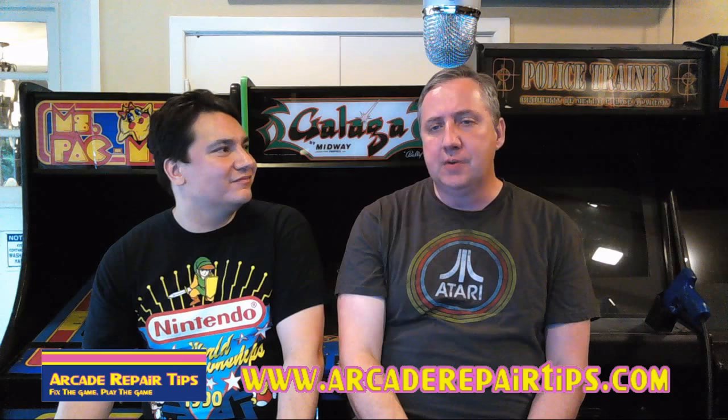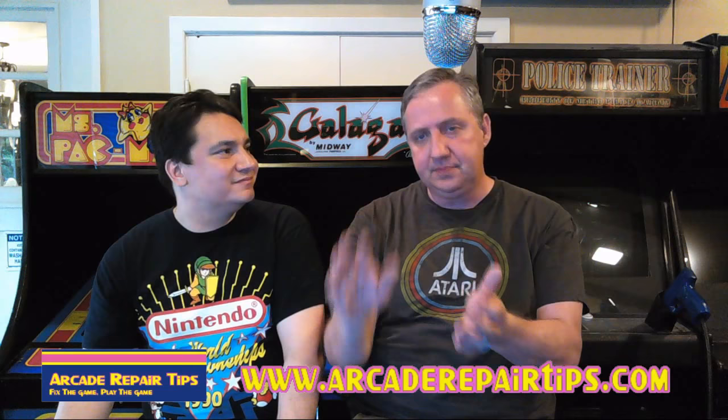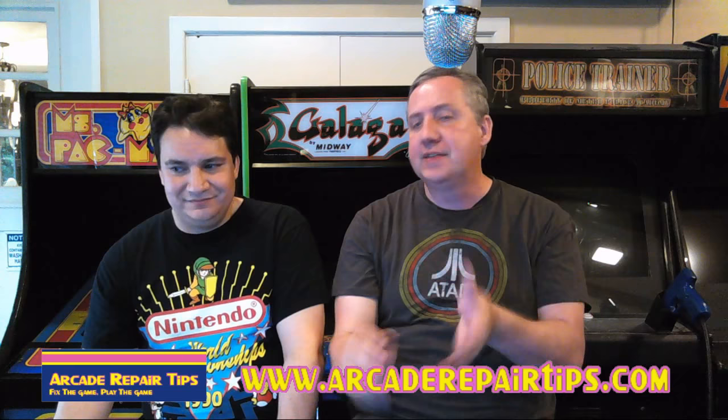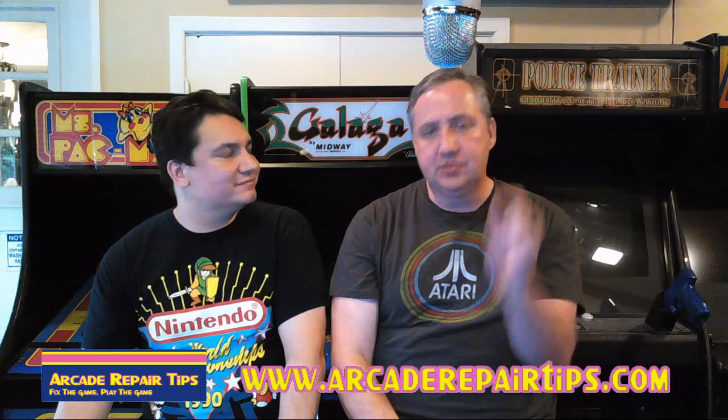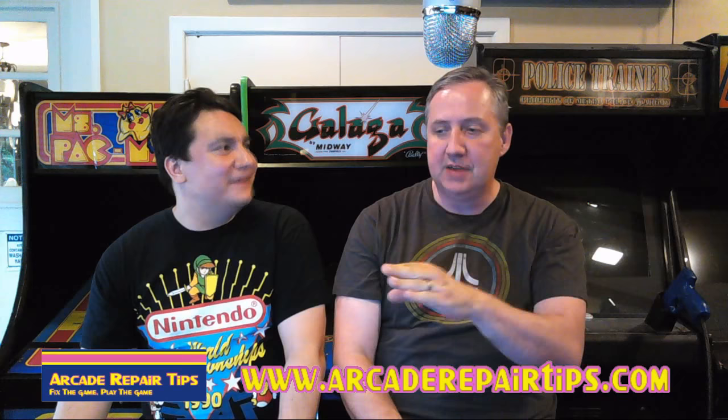But what's important is the cradle part that rocks. Right. That's why it's called a cradle. And it has a weight on it, and that weight will determine whether it drops the coin out over here, down to the switch, or rejects it back here. Exactly. So in the day, when we used to drill a hole in a quarter and put it on a string, you could get a lot of credits like that. The cradle prevents that, right? It will cut the string.